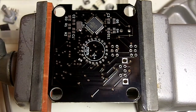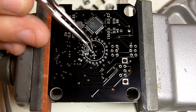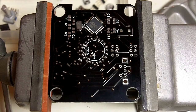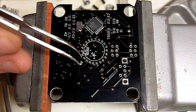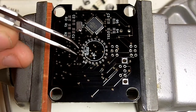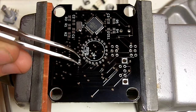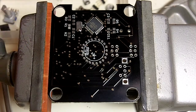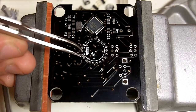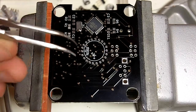We'll bring that up, and we'll grab two 4.7K resistors while we're in the parts bin. So R1 is the 10K. So we just grab that with the tweezers, which can be tricky. I'm just trying to get the numbers on it the right way around, and just drop that on the two pads, and then same thing with the two 4.7K resistors.